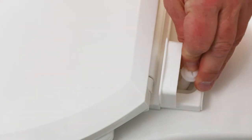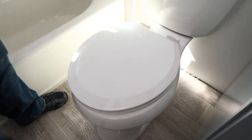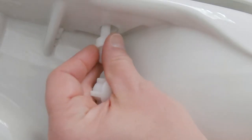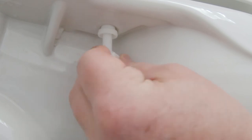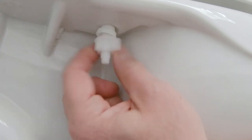Place the bolt through the mounting tray, mounting bracket, and mounting holes in the toilet. Place the never-loosen rubber washer and self-aligning nut onto the bolt from underneath the toilet. Turn the self-aligning nut in a clockwise direction to tighten.